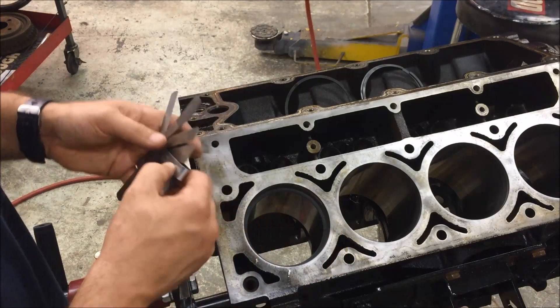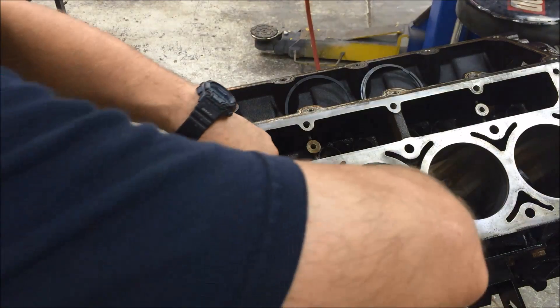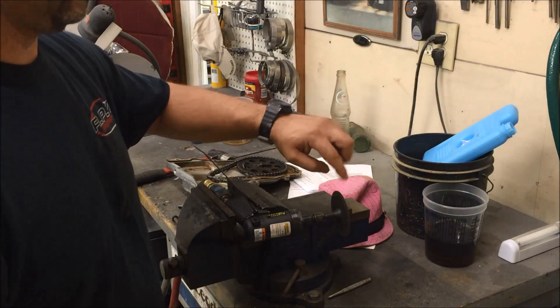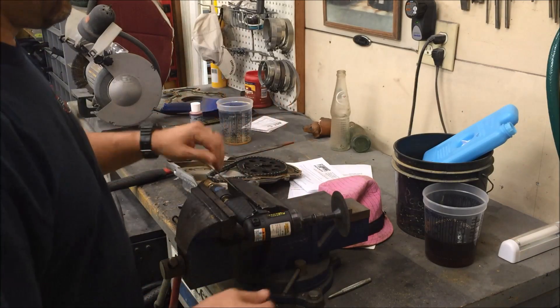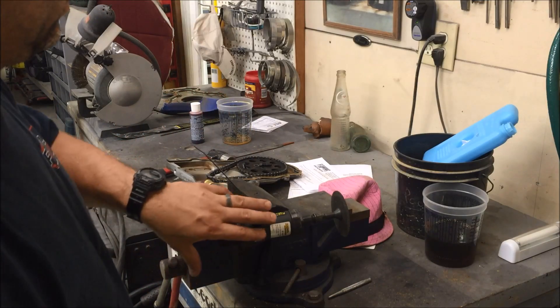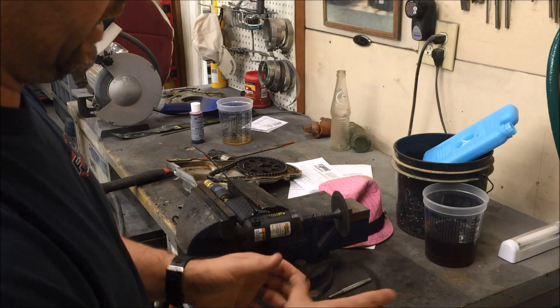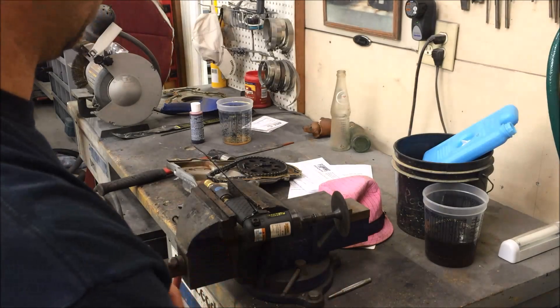I'm looking for 30, so to open that up I've got a rig set up over here on the bench. All this is is a die grinder with a three-inch cutoff wheel clamped in a device. I've got a zip tie that holds the trigger down, so I put air to it — it's adjustable speed and I've got it set down pretty low. Then I take the ring, squeeze it onto the disc, and slide it off as it's running.